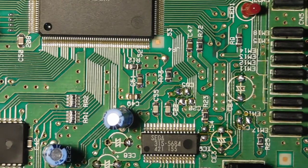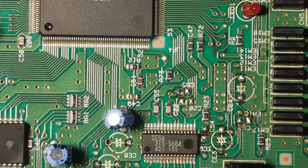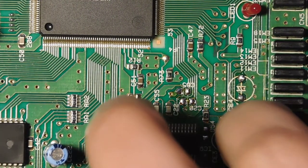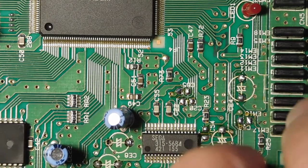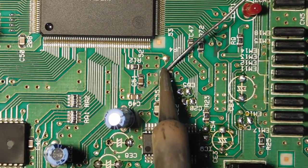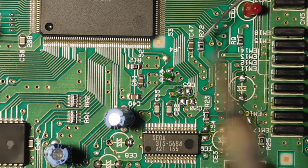All right, so I just realized I missed a few details that I need to correct. So one is that a component here, a ceramic capacitor at C68, also needs to be removed, and I had overlooked that. And then I also missed the fact that these two surface mount resistors also need to go. So that's R73